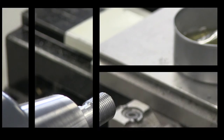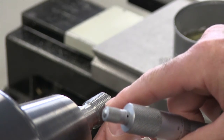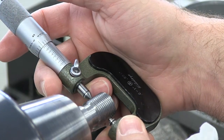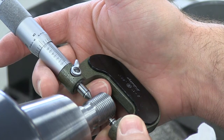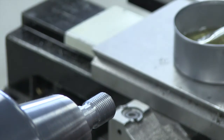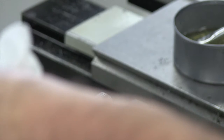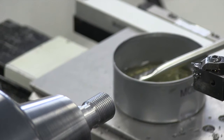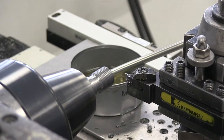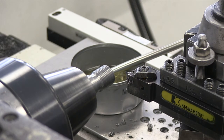I've cleaned off my thread. Notice the crest is very flat still — we know we have a little more on the compound rest to go. Our micrometer confirms that: we're at about 727 to 728 thousandths. The high, as you may remember, is 7079 — pretty close to 708 thousandths on our pitch diameter. That confirms we have a little further to go. I'm on 37 thousandths on my compound rest. These don't always work out just right — it depends on how hard you touch your workpiece and how deep you go. Our 44 thousandths calculated is really a target. Measuring is the only way to know if our part will pass inspection, so we're going to take some more cuts.